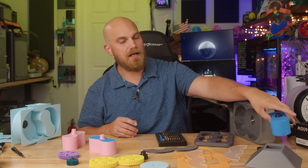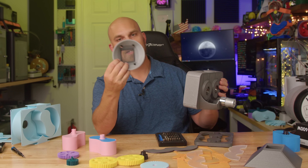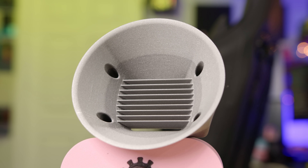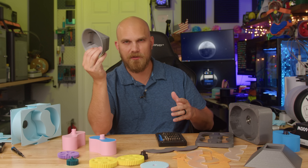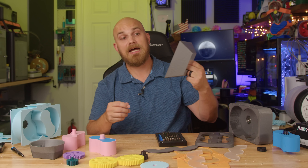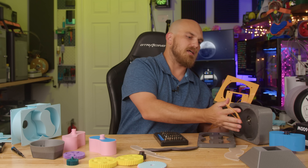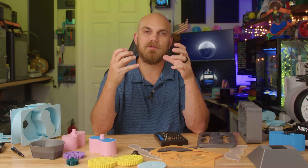I also made a velocity stack for the top, mostly because I think it'll help smooth out the airflow going into the case. I put some stator vanes in the velocity stack — I don't know if that's really going to help, but the idea is it might reduce turbulence going into the pump and make it function better. We can always remove this or break the vanes off to see if it helps or hurts. There's also a simple adapter to go from this case to the test bench we've been using for the fan showdown, and a bunch of TPU gaskets to seal up the cover, intake, and adapter — just to make everything as sealed as possible to get the best performance we can.